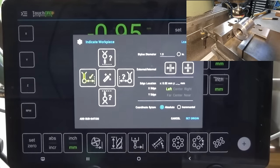Okay, I can feel some resistance with the Teflon against the ball bearing now, and that's not going to come off, but it can still rotate. There it is, all fully assembled now, and the way this would work is you push in on the lever, you can reposition the boss to wherever you want that to go, let it go and let it find one of the holes in the quill shaft extension, and then it just operates like a regular quill handle.